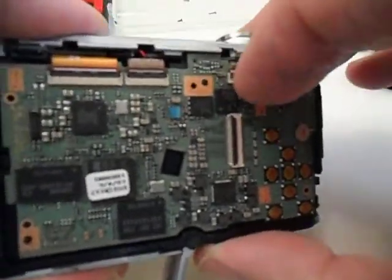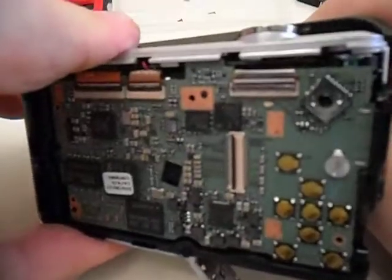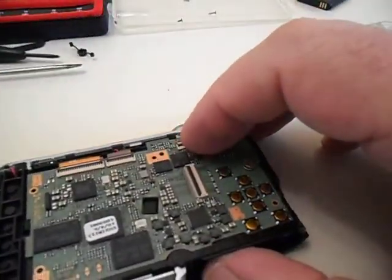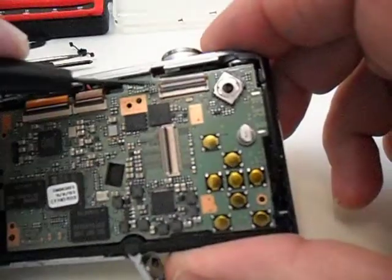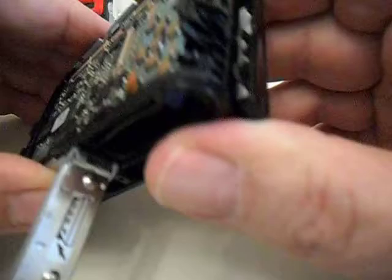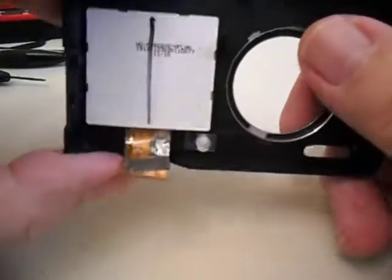So the bar on the camera is going to pop up with your fingernail — make sure it's up, which it is. Then you're going to pry off the front. Now there's the other part. You hear all that crackling noise in there? That little bar is up, and you just reach in there with something — I use a small screwdriver — and you pry up on here and pop it out, just like that. And then this now should come off. There's the front face plate — that's pretty well banged up too. And there's your strip.